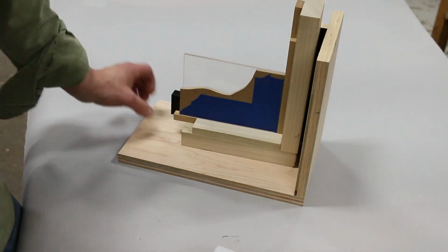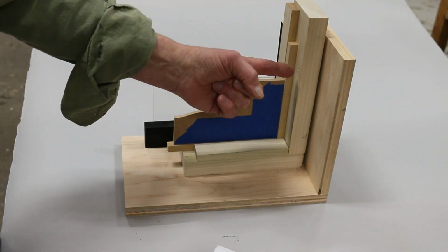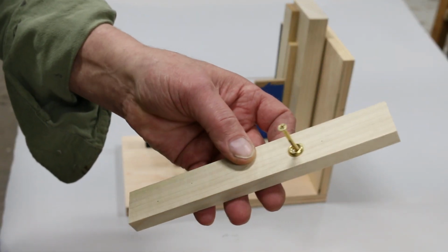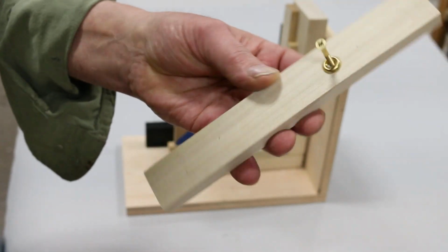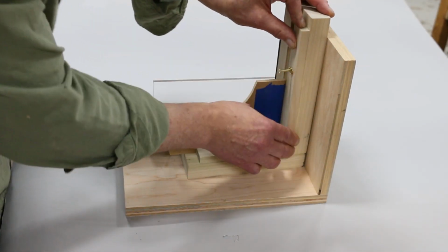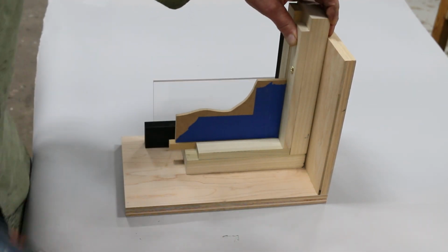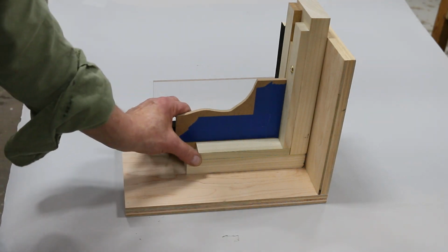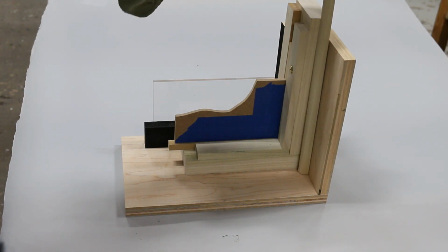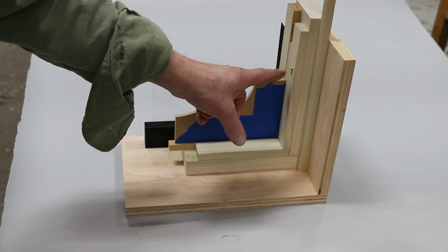You lift it in and then install it, and then you could screw, because the stop is off here, you screw in from the side, and then you come back with a stop that has something like, here's a finish washer. And then you apply the rest of your stops, the side stops, and that covers up those installation screws, and then you blind that opening with your final molding there. This makes the installation easier.